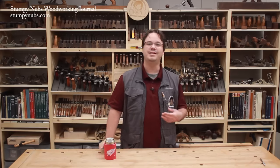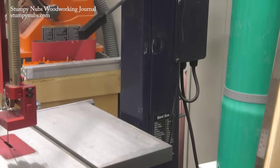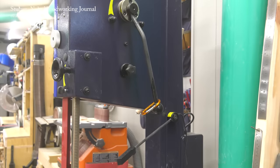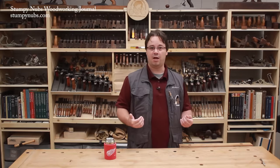So what about the differences between steel frames and cast iron frames? Steel frames are more rigid — they can be made in a single piece, eliminating the seam in the column, and they're often designed specifically for re-sawing with greater capacity. I'm not saying you can't re-saw with a cast iron framed saw, but if I was buying a new saw and I plan to re-saw with it, I would go with steel.